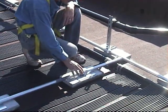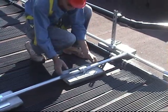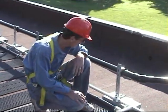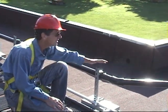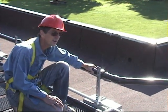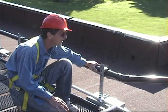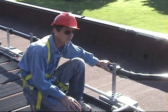We've glued these plates, which also have slip collars to accommodate movement — not that there is much movement with metal. Here we've elevated this pipe. We didn't really have to elevate it all the way along, but this way we can fill the whole system with water at the start of the year and test the system with water in it without having to actually run it.